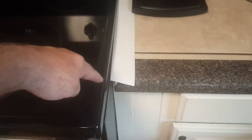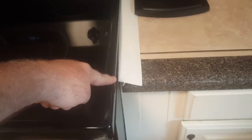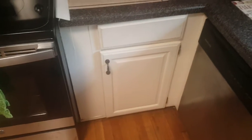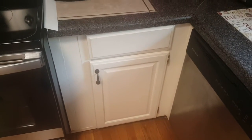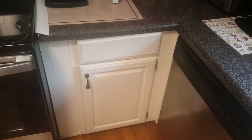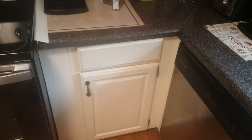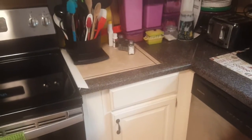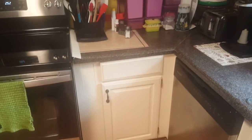Over here on the other side, this is 51 inches to the edge of this stove side. So a BLB 4851 pulled to 51 is probably the size of the blind corner cabinet we're going to need. If we made that a BLB 3639 pulled to 39, the door opening would only be about 9 inches. Right now, the corner opening that they have is around 15 to 18 inches. So much smaller corner access than they are used to. Make sure we change that to a BLB 4851 to make sure that we're long enough to make that pull.